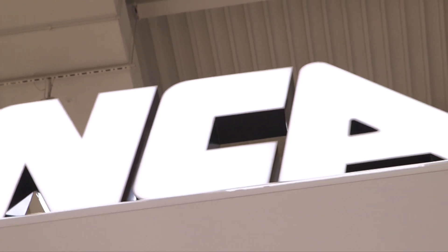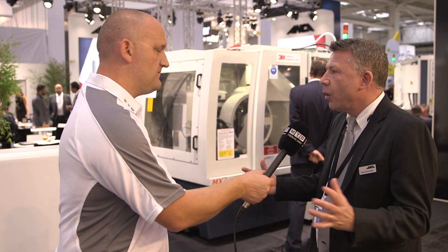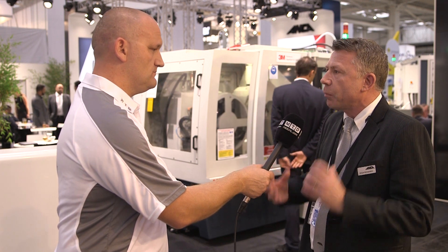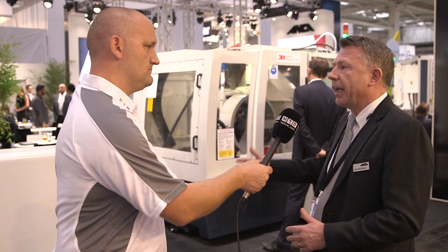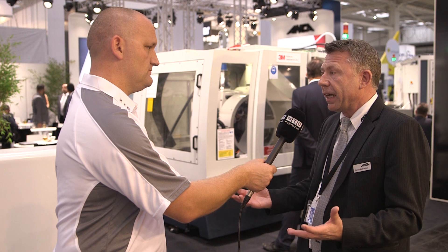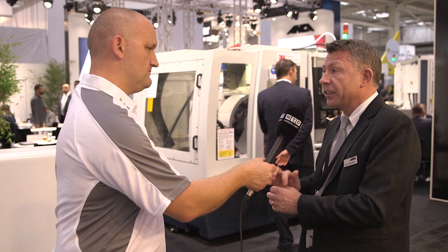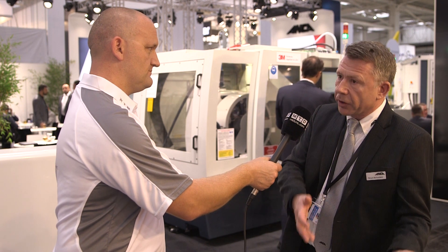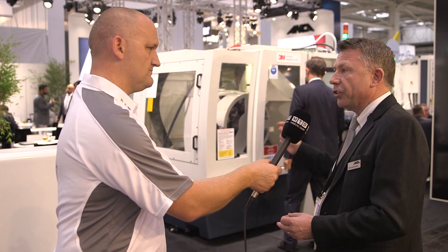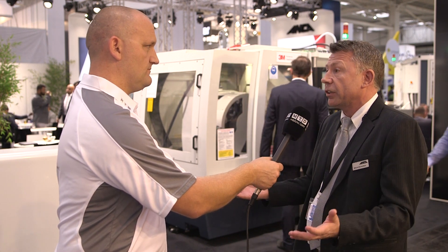So we're talking about automating low volumes — automating high volumes is quite straightforward, pretty much any manufacturer can offer that. But we're talking about maybe ones, twos, fives. Yeah, for small batches it's absolutely ideal. If a customer is doing small batches, high variety, this loading system with RFID is absolutely ideal for them. On top of that, we've got collet changing in this loading system to cater for different diameters. So a customer wanting to load five tools at 6mm diameter and then another five tools at 12mm diameter — we can change the collet into the collet adapter to load those types of tools.